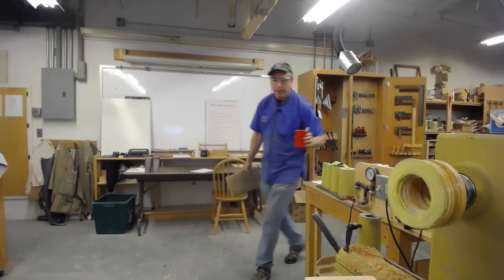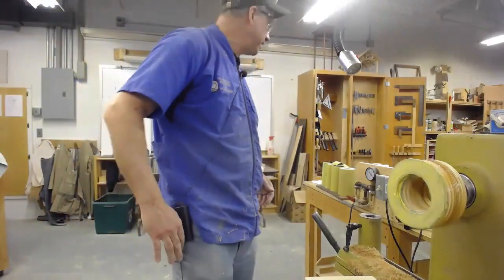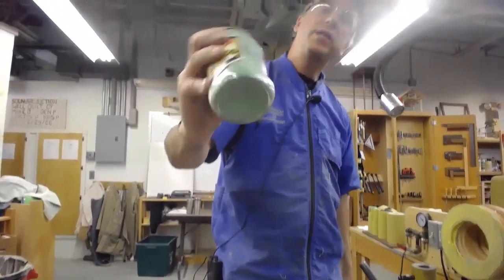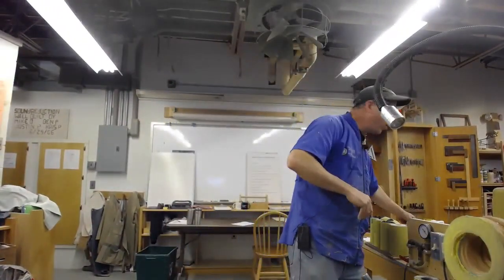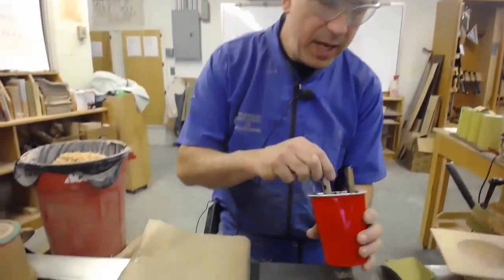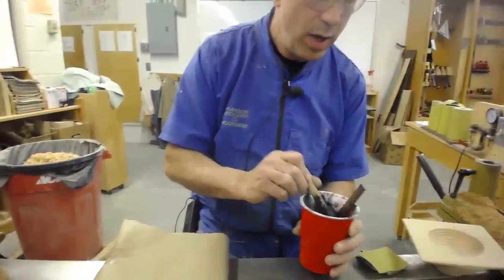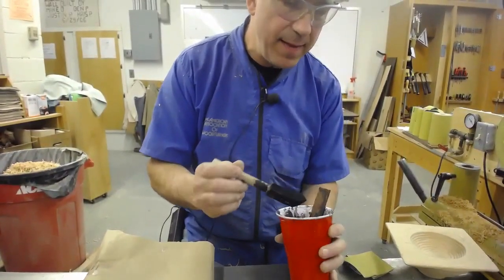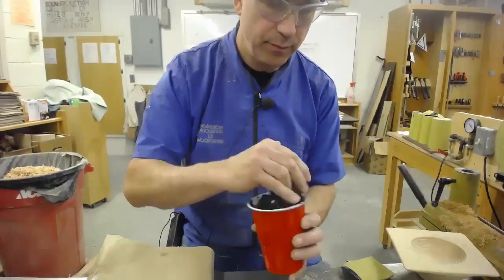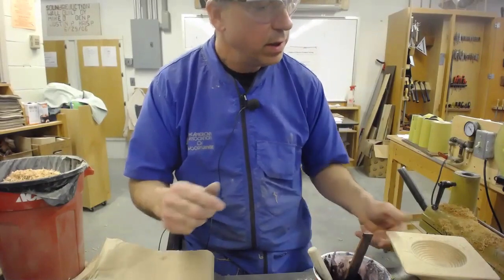The milk paint comes in a powder. They recommend you mix it 50-50 with water. Here's some I just put in a jar — the green — you can see the powder, it is a little granular. They recommend mixing it with warm water because that helps it dissolve. But I've mixed this much thinner than they recommend — more like a stain than a paint. Then you let it sit for 15 minutes or so and stir it up again so it's as dissolved as you can get it.